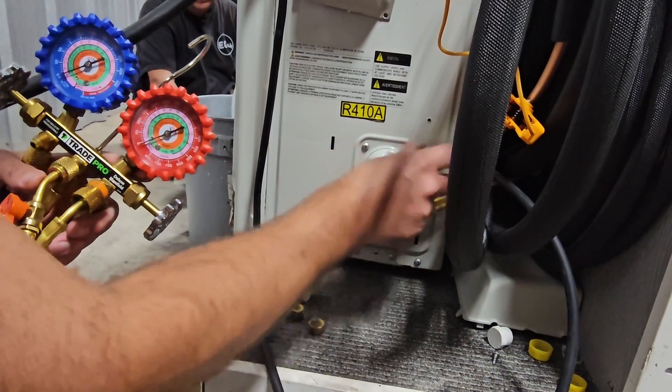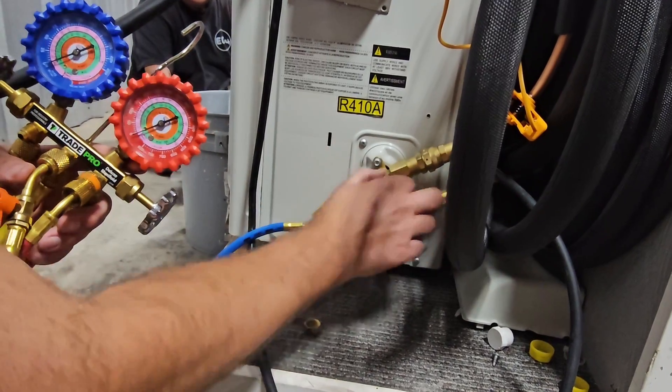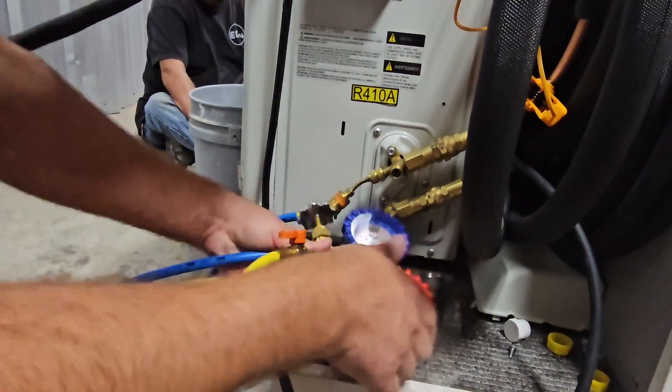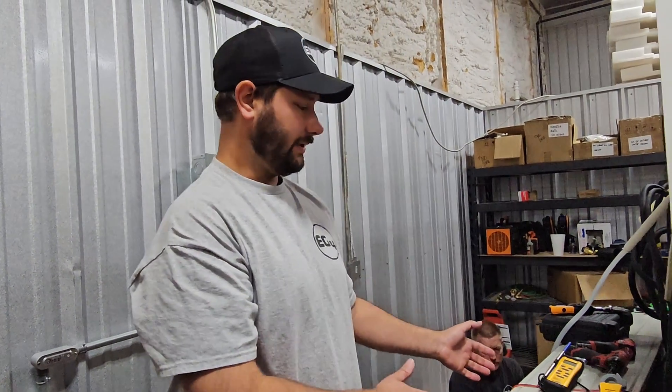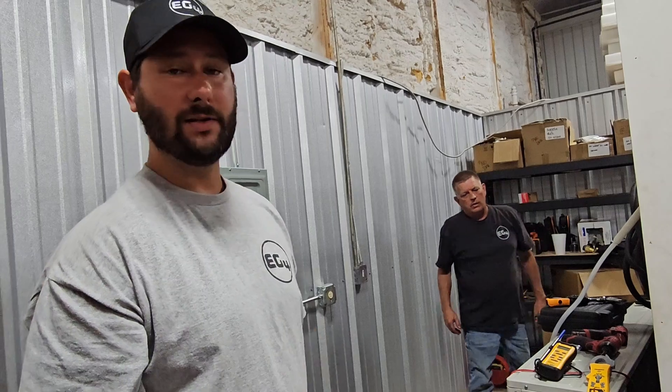And when it's closed, we're going to cut the breaker. That's how you pump down the refrigerant. Now we can take the unit apart — line sets and all — box it up, fill out our report, and our unit is factory charged.